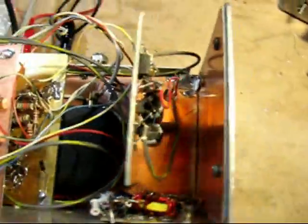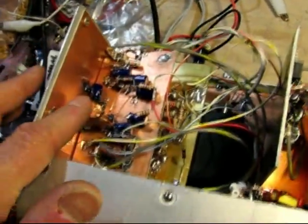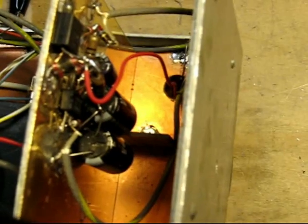What I've done here is stack the IF amp down below the audio board. The IF amp is down here, the IF board is here. If we zoom in on this, we can see how I solder the little square circuit board perpendicular to the main board, so I can run almost like a fillet weld right down in here. This is a technique I learned from W7ZOI, meaning I don't need to use a whole lot of hardware. The audio amp is just an LM386, which I might be switching over to a better op amp.